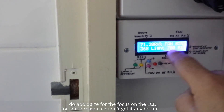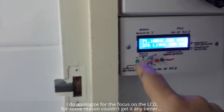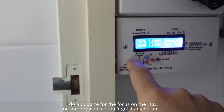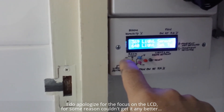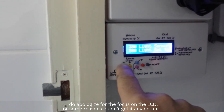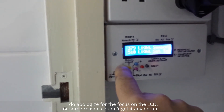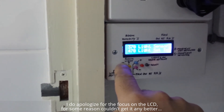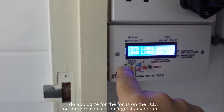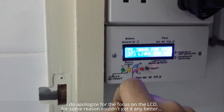The set point for the humidity and the lights can be adjusted over here with the keypad. So let's say I want to put the lights on — just to show you, I'm going to bring that number below the set point. Light set point, I'm going to bring it down. So as you can see, 670, 66 — it's coming down. I have set in the code to do increments or decrements of 10 at a time, so this might take a little bit. I'll bring that number now to 350 — the lights will come on. 350. There we go.